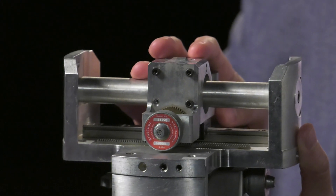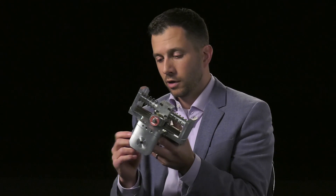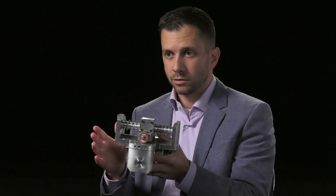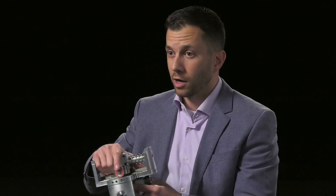The problem with this one was that tuning a mass spring damper is somewhat tedious. You have to stop the wind tunnel test, get in, and pull this out because it's down inside of the model. You have to adjust the mass, put it back in, remount it, wrap the model, and look at the effect. Is it what you want? If not, pull it back out, change the mass, put it back in, change the springs. That took a long time.